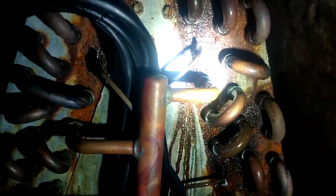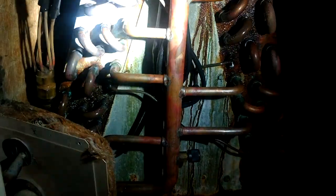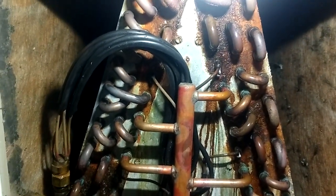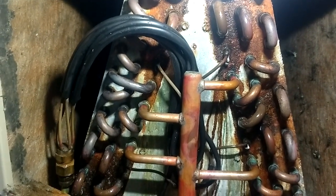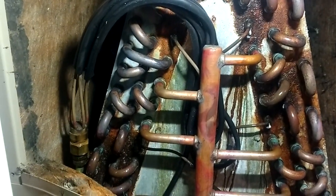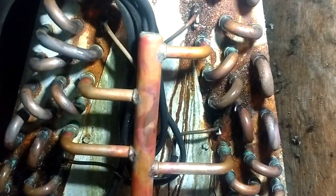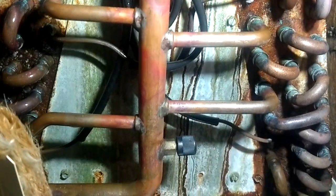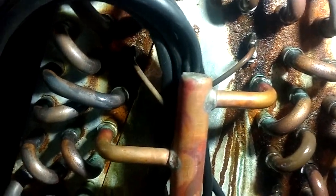She's toast. Finding a leak is using your eyes and your ears and just your senses — looking at this coil and seeing if there's an area that is kind of standing out. If you've got a coil that's fairly new, like those Lennox coils, most of the coil will be kind of silver, but then you find an area that is kind of abnormally rusted — rusted more than the rest of it — and you can see those trails coming down from where that one was leaking. That's a little bit of an indication of the leak there.